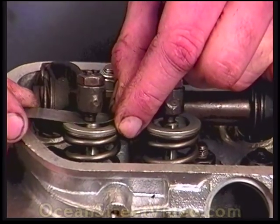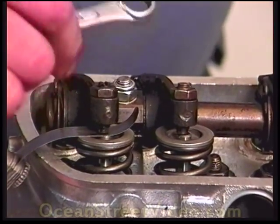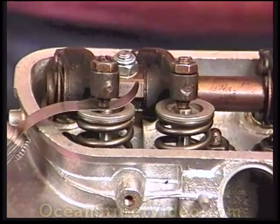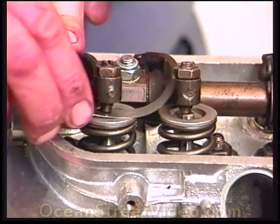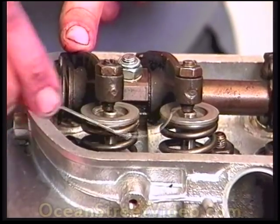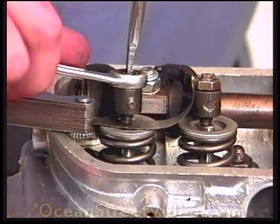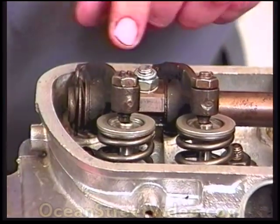You want to be able to put it in here, feel a little resistance like so. But you don't want it too loose either. Then go ahead and hold the little screw with the screwdriver firmly in place and tighten it down with the wrench. Then check to see if it's where you want it. This one here is just a little bit loose — slide your feeler gauge through there again. This is a little bit too loose, so I'm going to redo it. I'm going to loosen it up one more time. Now it's more what you want — it slips through there with a little resistance. You can hear the clack in there.